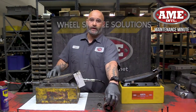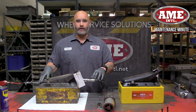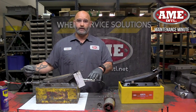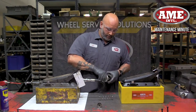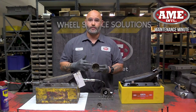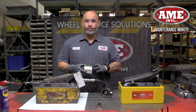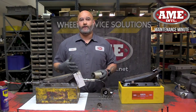Dry air motors — what happens? You start getting dirt and debris. Also, running too high of a PSI is a problem. These pumps operate between 90 and 120 PSI. If you start running 150 or 160, you're going to start getting all kinds of dirt and debris if you're not running any type of filter. What ends up happening on the inside is you'll start to scar up that cylinder. Mind you, these are aluminum — dirt and debris start chopping into that aluminum and you basically have to replace the air cylinder to get your pump up and running. It's somewhat of a pricey fix, but provided you use WD-40 or air tool oil, you should not run into any kind of issue.